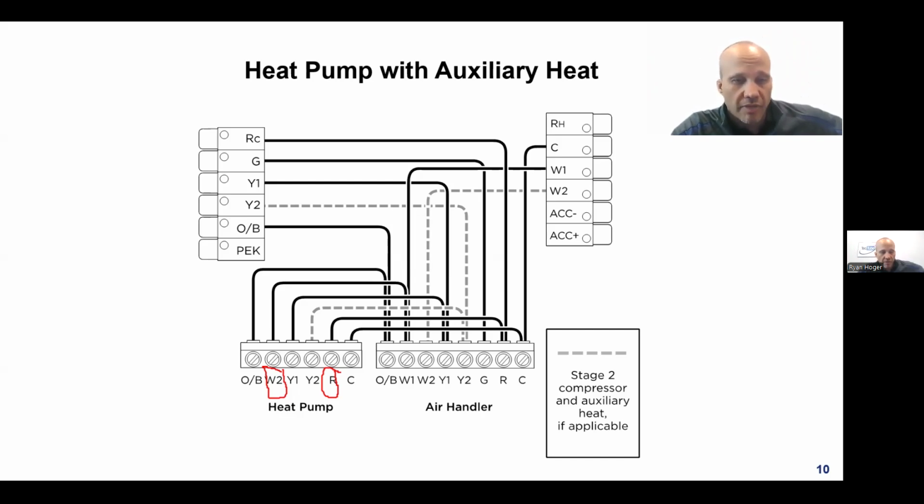So heat pump manufacturers know that, so when they go into defrost, they close an electrical contact on the heat pump between W and R, or maybe it's D for defrost and R. What that does is complete an electrical circuit at the furnace. The furnace doesn't know this isn't a thermostat. Over here at the thermostat, when something connected R to W, it said, oh okay, you want heat. Well, now something's connecting R to W. Oh okay, you want heat. It just has a second thermostat. It doesn't know you have two thermostats, and one of them's built into the heat pump. So that causes the indoor furnace or air handler to turn on its gas heat or electric heat to temper that air back up. So instead of 55-degree air blowing on someone, now you have 110-degree air, or whatever temperature air you have.